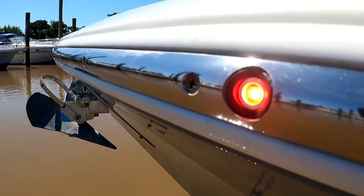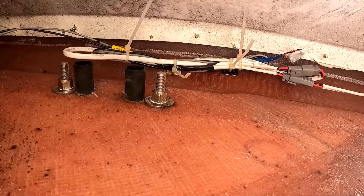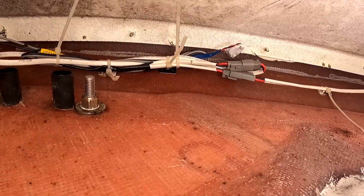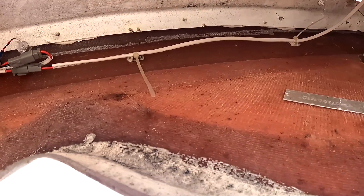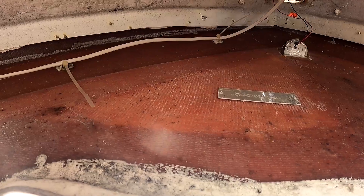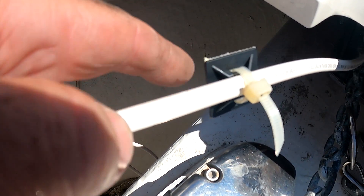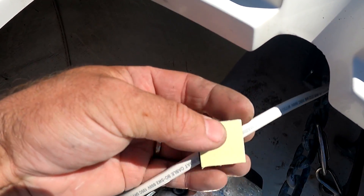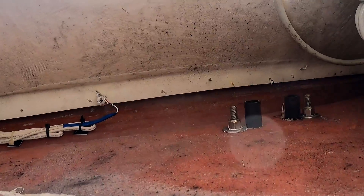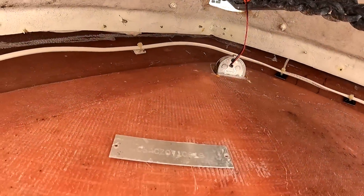Looks good. You're going to have existing wire tie anchors glued to the bottom of the hull that you could use. Where there aren't any, you're going to have to put some new ones, and I highly recommend wiping the area down with some acetone first. I even use some 3M tape prep solvent on the areas where I was sticking them. For areas that are really hard to reach, mount those tabs onto the wire first with your wire tie in a place where you can reach them, then slide your hand in and paste them into place. We've got all of our wires wire tied and secured, and we were able to use some of the OEM connectors.